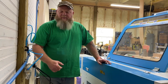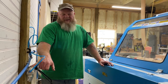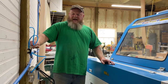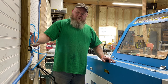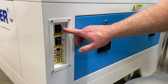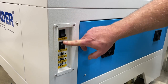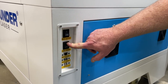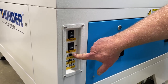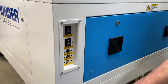Minor modifications — now we've got everything hooked back up. Pay attention to the directions on the air regulator; ours are set up a little bit different, but everybody's human. This is how we control everything and we can still get to the water separators. We have two switches: the main switch and the laser switch. The main switch turns on the main power and allows you to move the gantry; the laser switch turns on the chiller and the tube. Your ethernet, USB, and PC ports are there — she will eventually get this hooked up via ethernet, or you can run USB. When you're done, turn them both off.